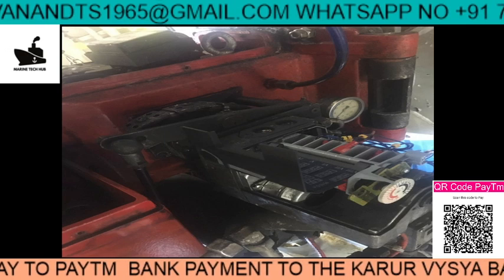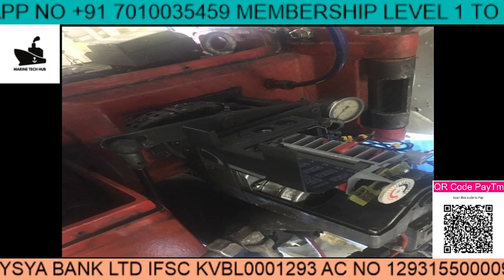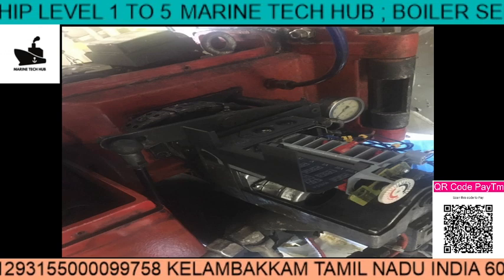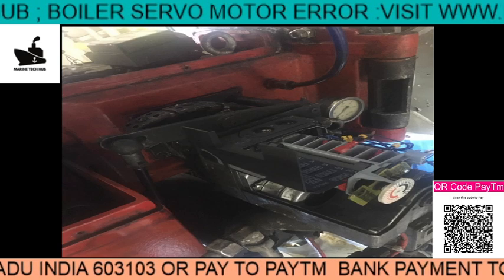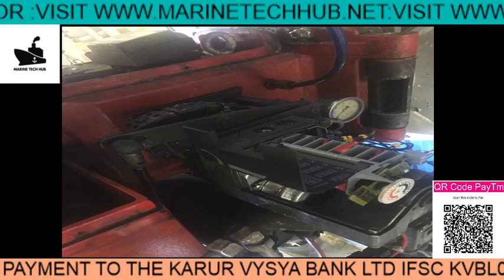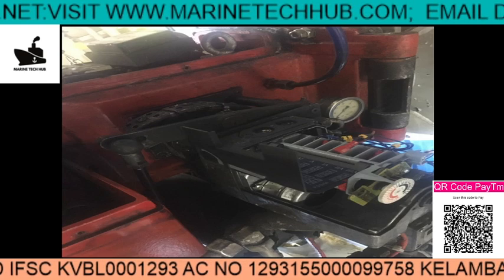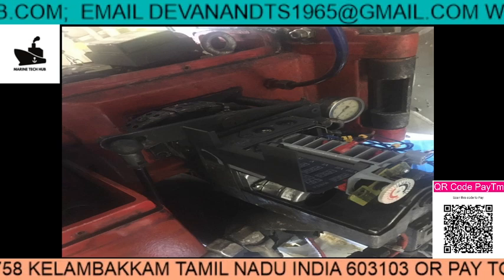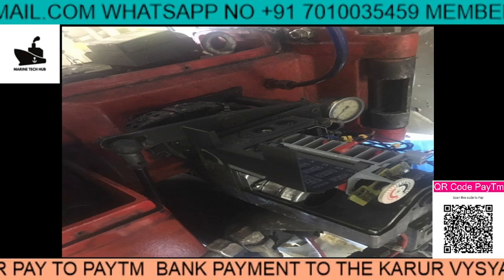We always have a lot of air servo motor problems. We also need to ask: the timer we mentioned — low combustion air pressure — we don't know if it is connected to the air servo motor or not. If you have any possibility to help us, please give us some advice on what to check tomorrow. Currently we have two problems: we cannot start the auxiliary boiler and we cannot start the composite boiler. The ship is underway but after five days we will not be able to start them, so we have a big problem. We are waiting for your reply — thank you very much.